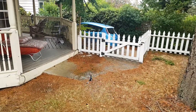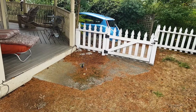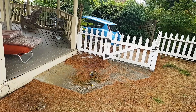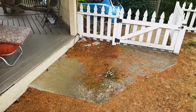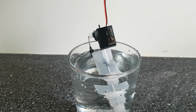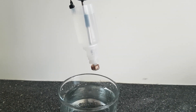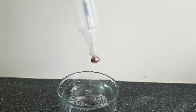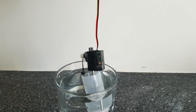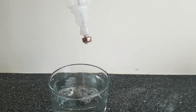The biggest restriction was how much weight the helicopter could lift. This Blade 120 S2 can lift about 50 grams at the absolute maximum, and maybe 40 comfortably, so the entire setup including the water had to weigh noticeably less than that. That meant the sauce bucket was too big. Instead, I cut the bottom off a paint bottle and made a valve mechanism out of the bottle's own nozzle. The servo is connected to the plug at the bottom and moves the outside of the bucket up and down — in the down position it forms a seal, and when it's up, water can flow out. It holds about half an ounce of water, which isn't very much, but it's the most the helicopter can lift. I put a metal weight on it to help stabilize it, but that turned out to be a bad idea later.